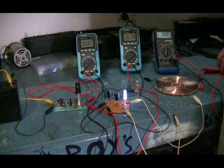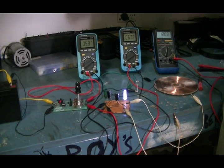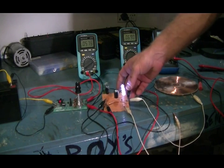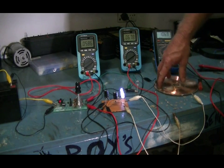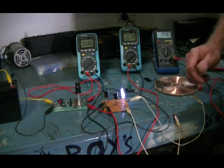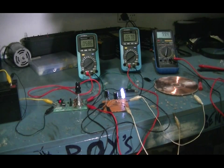And like I showed you before, if you place the load on that cap, it doesn't affect the brightness of the LEDs, but it does drop the current draw down dramatically. So anyway, let's hear your thoughts on that — how do you get a reverse voltage, a reverse current? It just has to do with the inductor collapsing and the voltage potential going down further, and the voltage we're putting into it which is about 5 volts. So then our positive rail becomes a negative voltage and our negative input becomes a positive potential. Alright, that's it from me for this one. Enjoy, thank you.